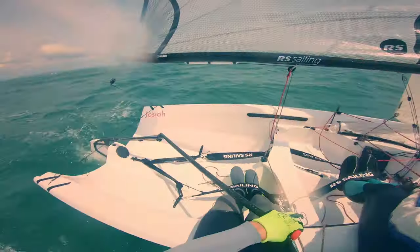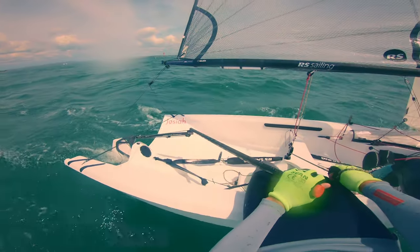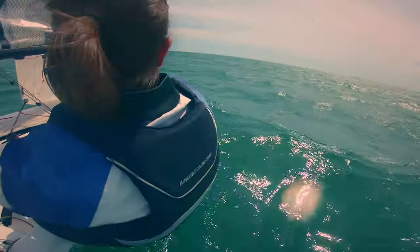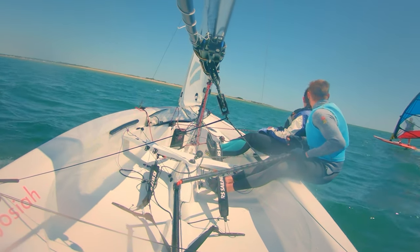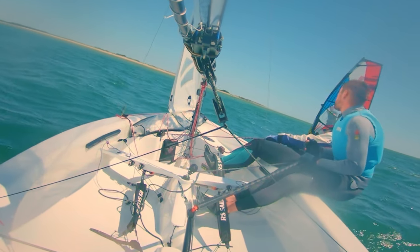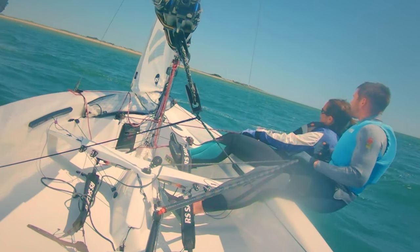Here we are in action — top system. Single splice, so quick to adjust, always perfectly aligned to the centre of the boat, no metal for the Dyneema to wear on, no loose tails to get caught in the mainsheet. Great system, top bimble. Hit the like button if you've found this useful.